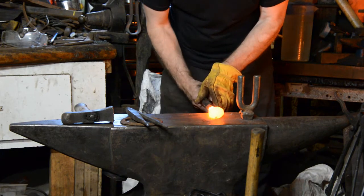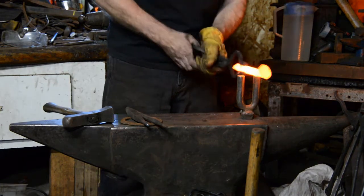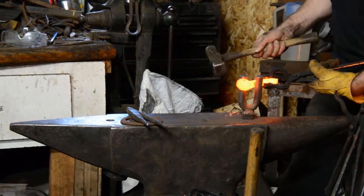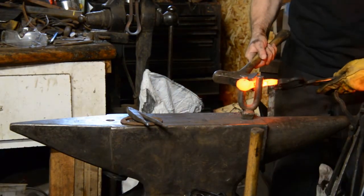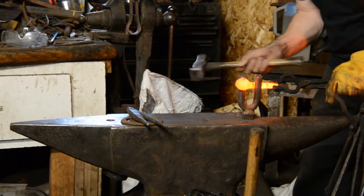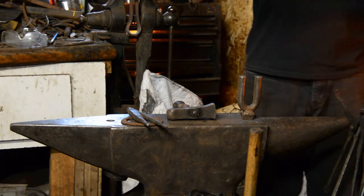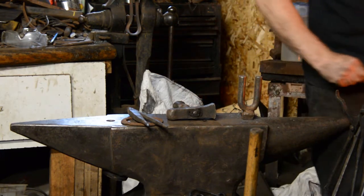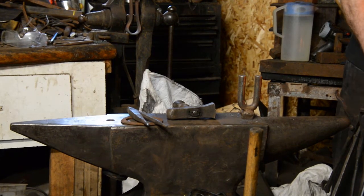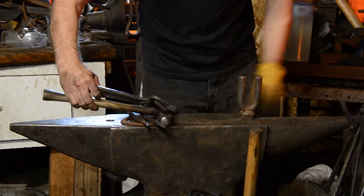What I will do is talk about chromium. You guys have all heard of chromium steel? They all look at me like I'm crazy. Well, it has another term — stainless. Have you heard of stainless steel? That's what the chromium does. The chromium is what makes it stainless. Now, I have a piece of steel back in my shop which is stainless — and it's pretty rusty. So stainless doesn't prevent it from rusting, but it greatly increases the amount of time it takes to rust. It's inhibiting the reaction of the iron and the oxygen.